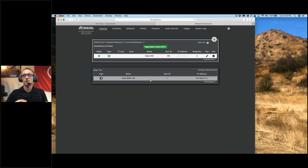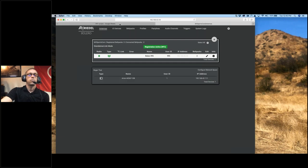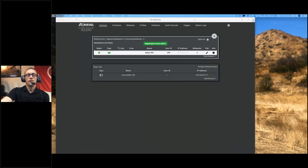Boundary clock, all those kind of things are things that you need to look at inside of your system and determine, can your network handle it? Because the system is built to handle it. The question is more of a network. How can the network handle it? There was an early time when we said 3 hops on an unmanaged switch, and a switch that didn't have PTP boundary clock and those kind of things inside of it, something that wasn't a PTP aware switch. So we really have to start asking ourselves those questions. It's more of a networking question, really.